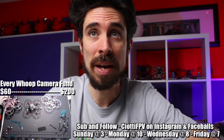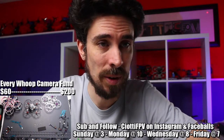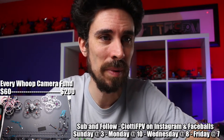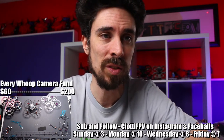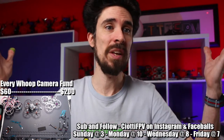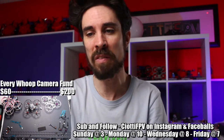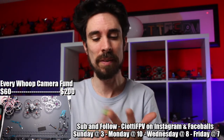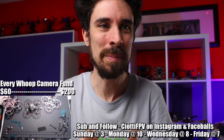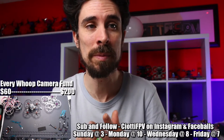Matty O says flickering cam. Has it gotten any better? Gray Hat has a Hummingbird with a VTX that's broadcasting on the wrong frequencies. I set it to R8 and it ends up sending on L7, tested with multiple goggles. That is probably a VTX table issue. One of the awesome things about Newbie Drone is that you can send them an email and say, hey, this weird thing is happening, how do I fix it? And they'll send you an email back that says, here's how you fix it. It's crazy. We don't get that kind of customer service from many places in FPV. So do it. Send them a message. They'll get you straightened out. Sounds like a VTX table problem to me, though.